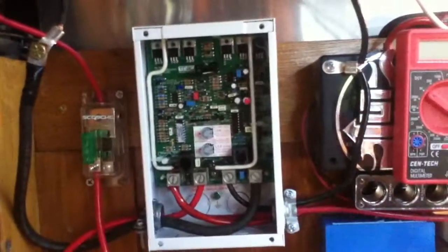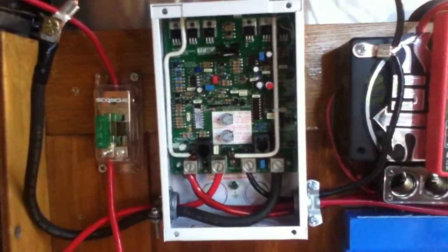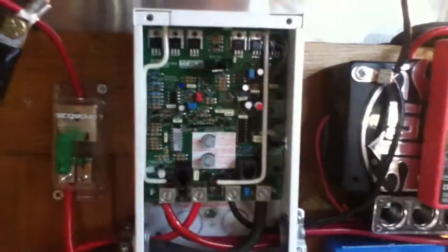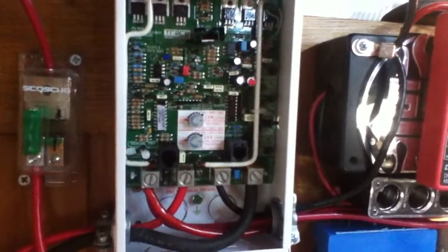When these come out of the box from the factory, they're pretty well set up as a charge controller for 12-volt systems. If you want to do anything other than that — and it does do other things — you have to move the little jumpers around that are in here. When you're getting into that, if you can get a hold of some hard plastic needle-nose pliers, that's a good way to work with these things.